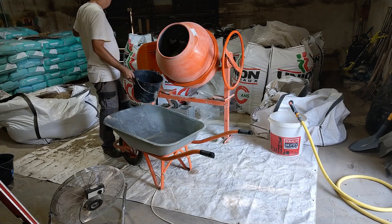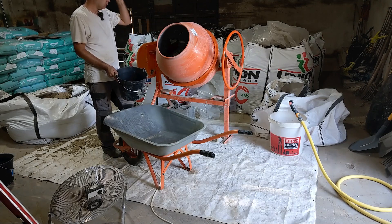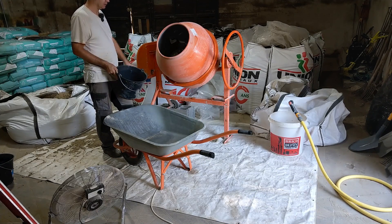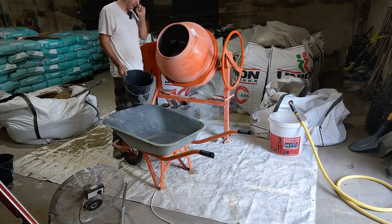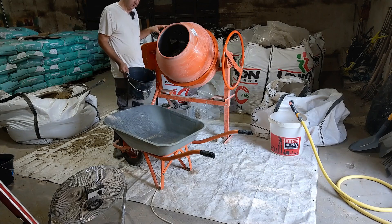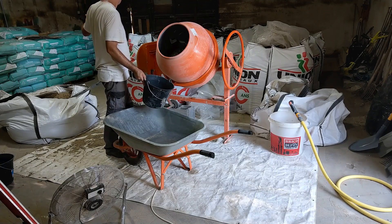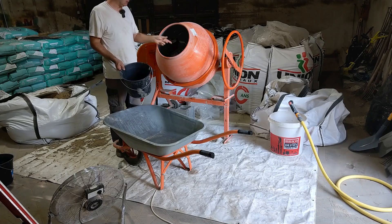Basically a bag of cement makes the concrete - you stir that up dry. I'm gonna do half of it dry, mix that first with half the bag, add the other five buckets, put the rest of the cement in, mix it again, then add 17 liters of water. This mixer holds 140 liters but I won't put anywhere near that much in. I should get about 100 liters out, which is about two wheelbarrow loads - the wheelbarrow is supposed to be 90 liters, so I'll just do about three-quarters full.